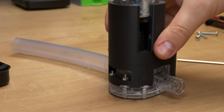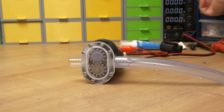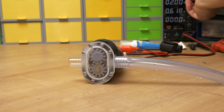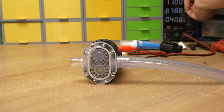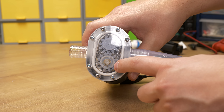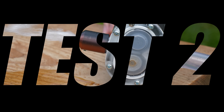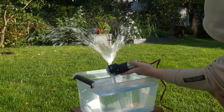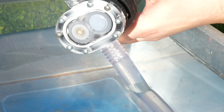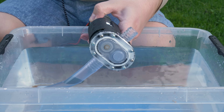The transparency of the water pump is now covered by the mount, but it's way more powerful than before. I didn't want to run this pump dry, but I had to see if it even works — and it did, though after a short period it started melting the acrylic. So no more running it dry. Outside, we can instantly see how much better it works. It now self-primes without problems and the performance is noticeably better. The spread of the water looks like a shower, but I think it's due to the wide outlet nozzle.